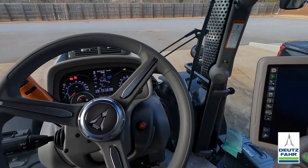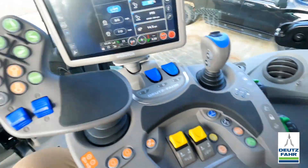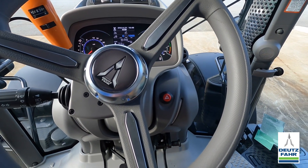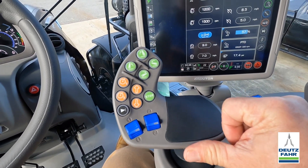This is a TTV transmission — in other words, a CVT transmission. You can run this in manual mode kind of like a power shift if you want. You put the tractor in forward or reverse. This tractor has an electronic park brake, so I can release it by pressing the switch, or as long as I'm in the seat I can throw the shift lever forward, give it a little throttle, bump the shift lever, and the tractor will start moving and the brake will release on its own.